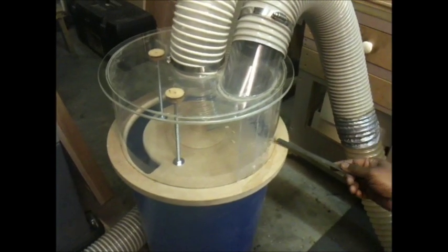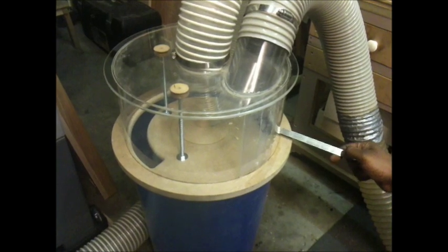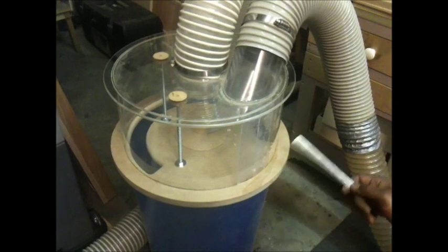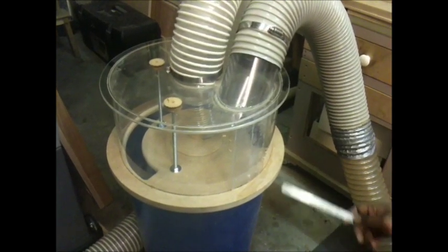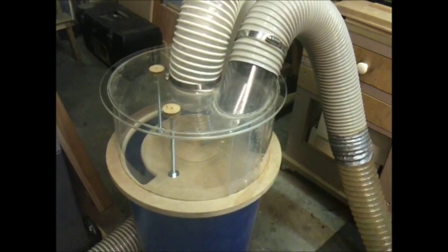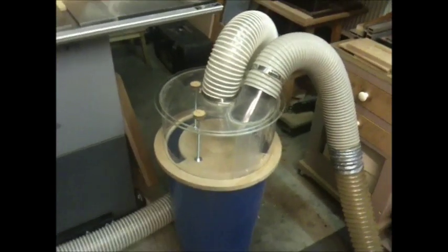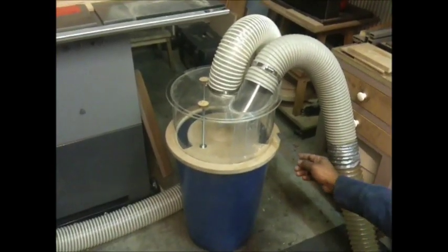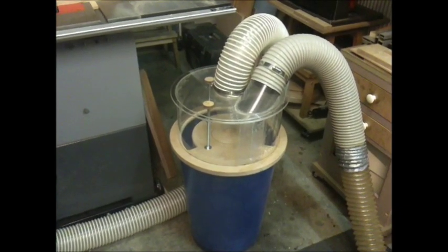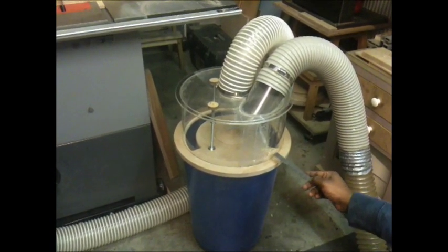As you can see here, there's a bit of debris that is collected — that's merely a little bit of turbulence that occurs at the end of the cutout, and that causes that to build up. So if the extractor is left running for a while, that will disappear in time anyway, and usually that's not a problem, because once that collects, the rest of the cyclone carries on as normal and it shouldn't be a problem. But if you really wanted to solve that as well, you could introduce little fins on the sidewall of the separator to direct airflow so that that gets taken away.